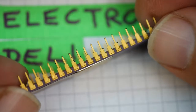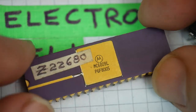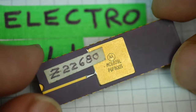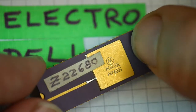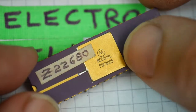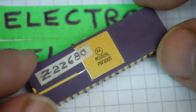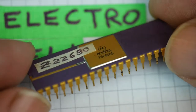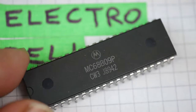Underneath has the pins — again, a little bit of grubbiness from the black foam it was stored in. Isn't that a nice package? This is typical of a chip in the early stages of its manufacturing cycle — it'll be made in a ceramic package. The ceramic is something like china or pottery, almost glass-like, so it's a good insulator, a hard material, with good thermal properties for getting heat out of the chip. With the cover brazed on — not soldered, but brazed — the thing is very well sealed against environmental dirt. That's why they did them this way: a high-quality package that cost much more to make than the standard moulded epoxy we're familiar with today.